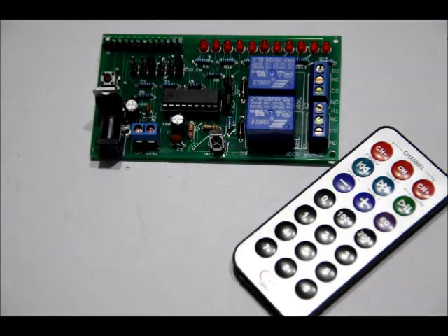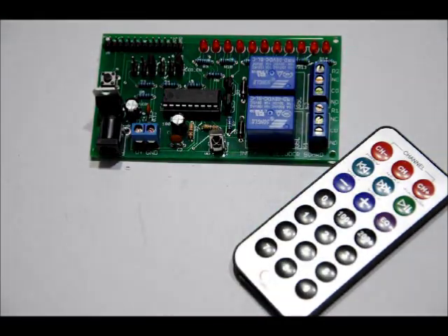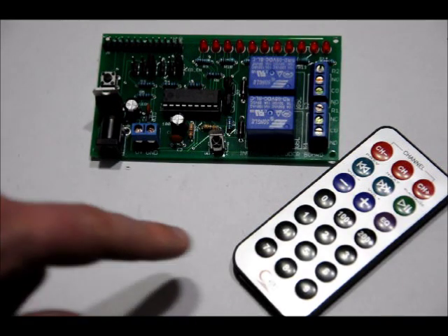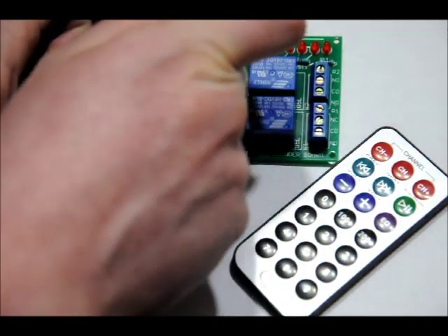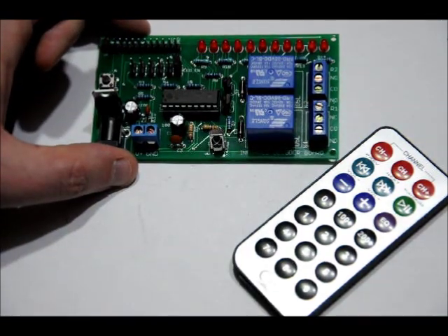So I'm going to unplug the unit. That data is saved, and I can reprogram it just as easily. I can power it back up in program mode and program in a whole new set of buttons — it's saved to internal EEPROM. So right now, when I remove the program jumper and power it back up, when I press those buttons, the relative LED is going to light up and the relative output is going to go high.